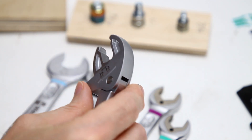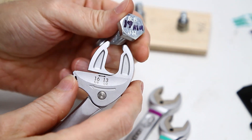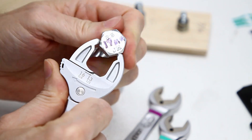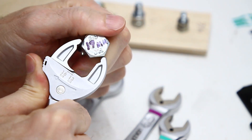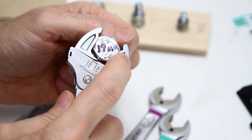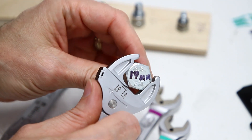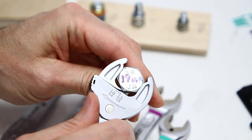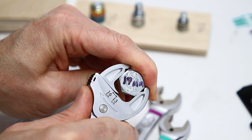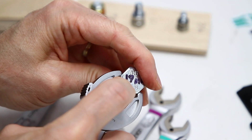That covers SAE sizes, and I know there are people watching who don't use SAE sizes. 19 millimeters is the maximum, and you really have to push this on. The 30-degree detents do not work with a 19-millimeter bolt, but it does catch a 19-millimeter — it does work. The self-adjusting ratcheting action does not work at 19 millimeters; it's totally maxed out on its width.